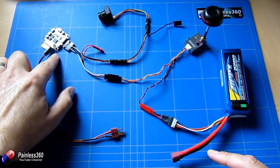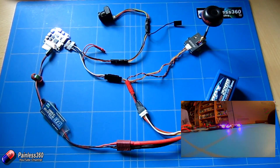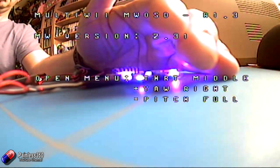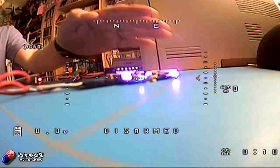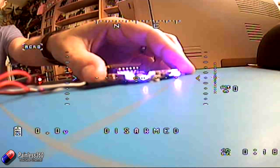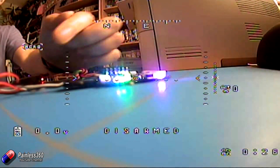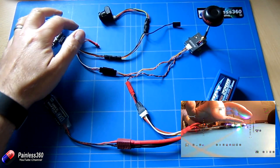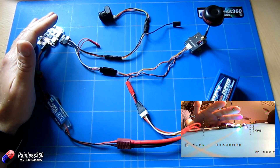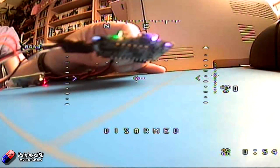Powering the board up and the little on-screen display light should come on too. There's the board booting, there's the little OSD light — a little yellow light pulsing away at the front. Here we can see the screen — looking out of the camera with all the information about how everything's working. Moving the board, you can see the artificial horizon moving. Twisting it, there is everything going — the status of how the board's behaving. The battery stuff won't work because VBAT isn't connected at the moment. Rotating the board, you can see the heading change. It's all working.